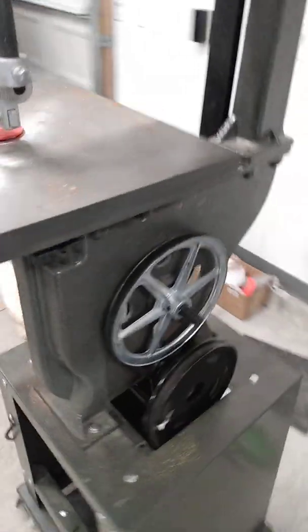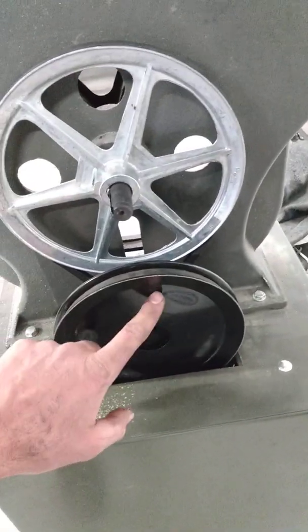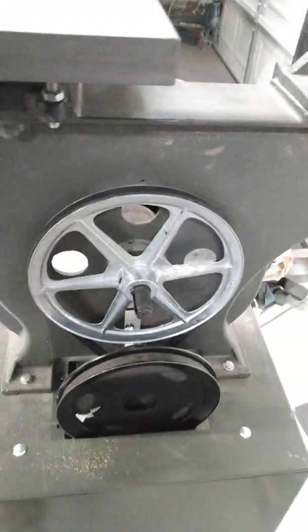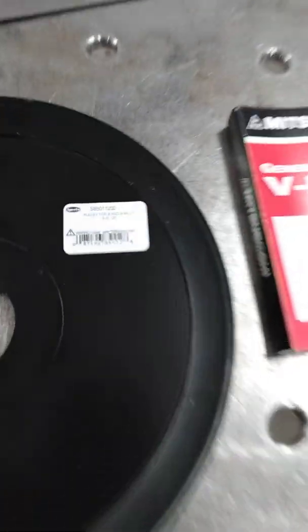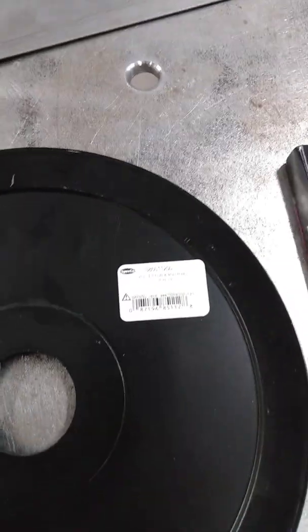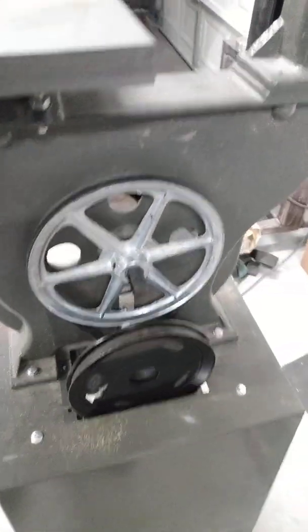Three things, less than $50 total — about $27 for this pulley, $7 for this one, and $7 for the belt. Here's the part number for the belt. The Ace Hardware pulley part number is shown here — that's the 9-inch. You'll need the 8-inch otherwise the RPMs will be too low. And that one from Amazon is the 9-inch OD, 3/4-inch bore with the key. Thanks everybody.